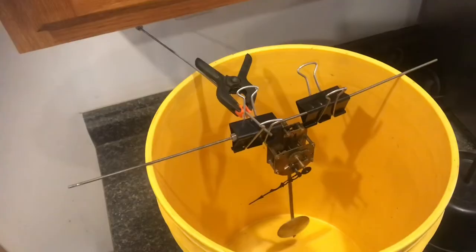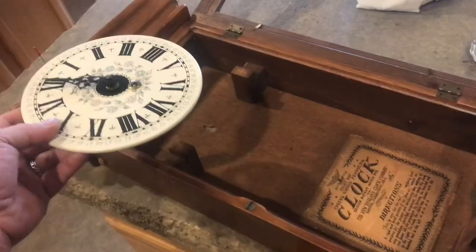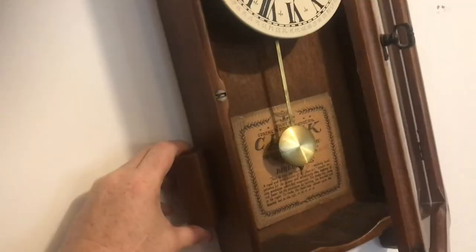Put the plate on that connects to the dial. Place the dial on and attach it. Put on the hour hand, the minute hand, and add the dust cover. We'll insert the clock into the case, tighten everything up, set the pendulum on, place it on the wall and make sure everything's balanced. The key will wind it up — of course not too tight. Give the pendulum a little push. So nice to hear it ticking again. Close it up and enjoy the time.